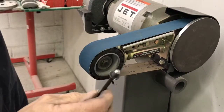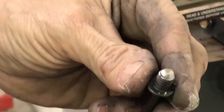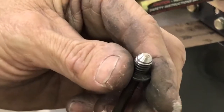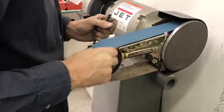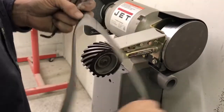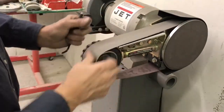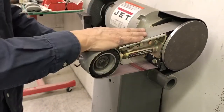So what I've done at this point is put a little bit of a point on the end, because in this application we want to put a point on it so it will stay put once it goes in the hole and bottoms out and butts up against another piece of metal. To release the belt I just simply push down, pull that off, grab the 220 grit trizact belt, put that on there like that, released it, and it's ready to go again.